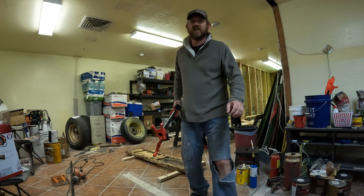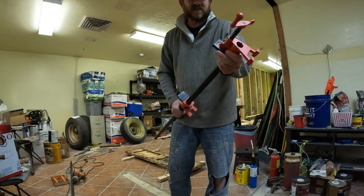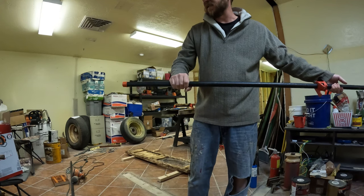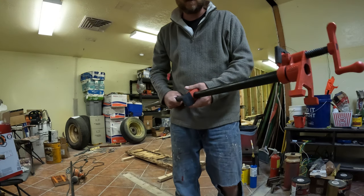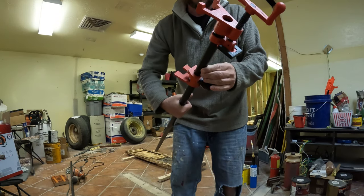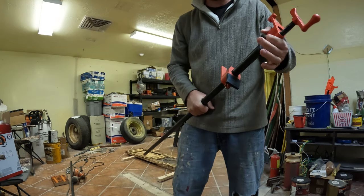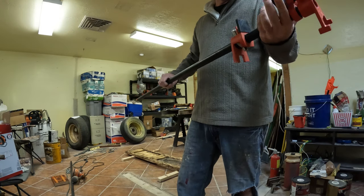By the way, these clamps are awesome. I know it sounds silly, but they are so cool, because you can use 3/4 pipe, any size, and basically create clamps for that size. I think we found these at Home Depot, I'm sure all over the place. These two little pieces slide on, and then one goes on the threaded top, so you have to make sure the pipe is threaded on one side. But you get them pre-made, sized. Any size you can make your clamps.